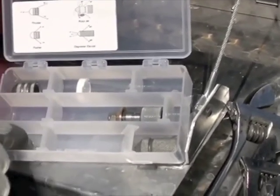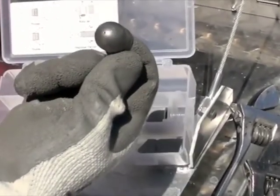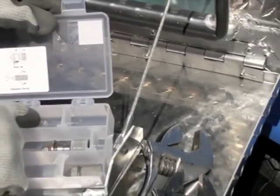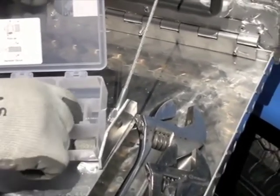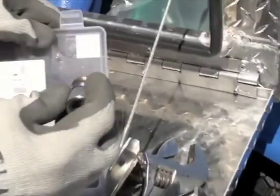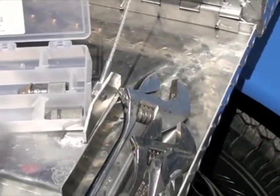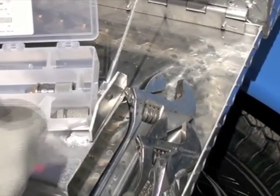You also got your button nozzles. One's a flusher. That's the thruster, so it's got a hole in the front. And this one's just a flusher, just has the rear nozzles. Pipe clean out, or your nozzle clean out tool. And this is your Roto-Jet that cleans the sides of the pipe. Warthog's kind of replaced all these, but again, price-wise and return on investment consideration, these are still doggone good nozzles.